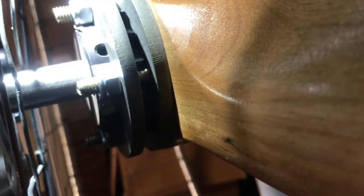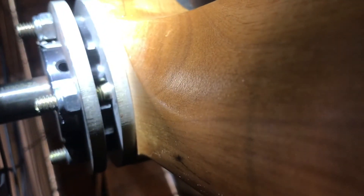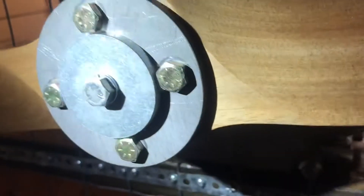It's kind of hard to see, but on the hub of the sprocket I've got a piece of metal — I had this water jet or laser cut. It's like a big washer but it has four holes in it that match up with the notches in the sprocket. Then on the other side I have another piece that has the same four holes but a smaller hole in the center. That one has a 5/16" hole in the center, and then there's a center bolt that actually screws into the shaft on the motor.